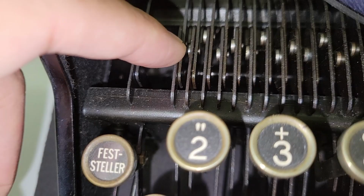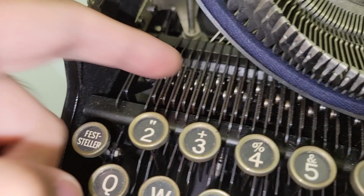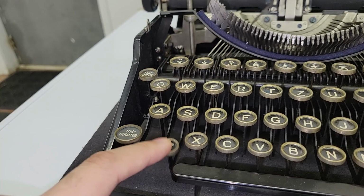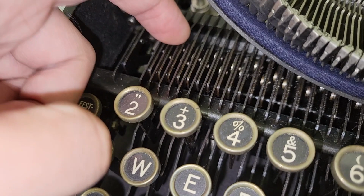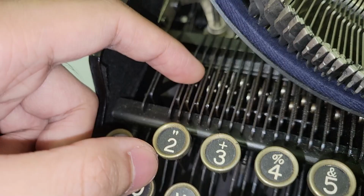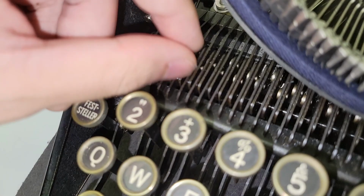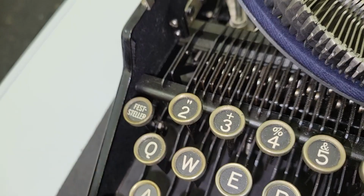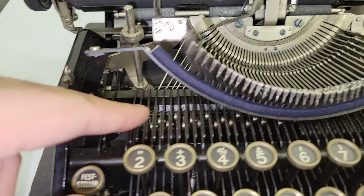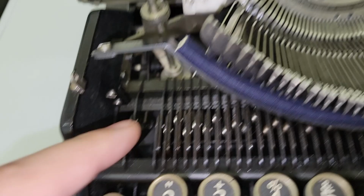So in this case, for the longest key levers, they position the pivot further forward. That's because for the same displacement here, when it's longer over here, as opposed to here, then you'll actually get a larger displacement on your shorter key lever because of the ratio between this length and this length. So to compensate for that, for the longer keys, since there's a lower displacement, we need this radius of rotation to be smaller, while here, since there's a larger displacement at this point, we need to make that radius longer. That way, the overall rotation of these bell cranks will become the same, or also compensated to handle the fact that these are not the same length, and they're pulling from different parts, and there might be some error because of this angling.